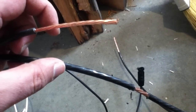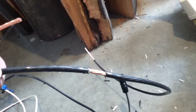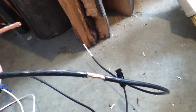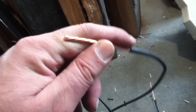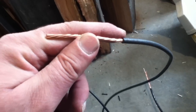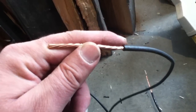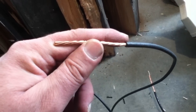One of several ways to keep that from happening is with main lines. The way I wire things up, I like to use number 4, 6, and 8 cable for main lines, and then I take the skinnier lines and attach them to it. This here is a number 10 cable coming off one of the 145-watt solar panels. You'll see as thin as number 12 line coming off 50-watt solar panels.